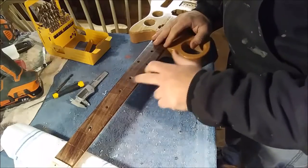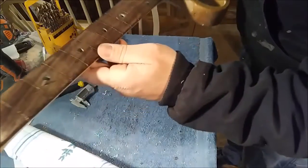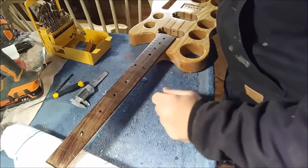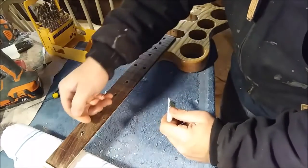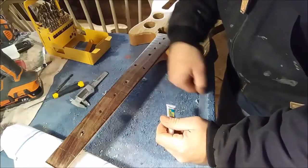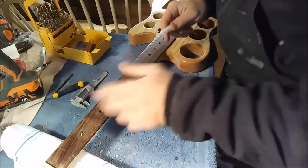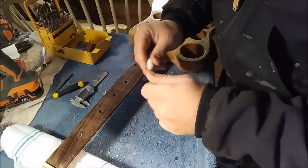We are back and I got all the holes drilled out. Everything looks good. The only thing is up at the first dot you can see that a piece of wood lifted up - that's not that big of a deal, I'll show you how I'm going to fix that. Just take some super glue, peel it back with my finger, lay a couple drops of super glue in, press it down, hold it down for a couple seconds, it'll start to cure, dry, and will be good as new. You won't see it once I sand it and get the dots in.